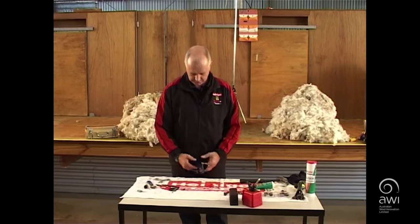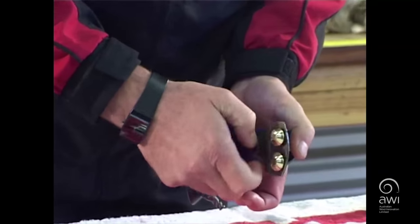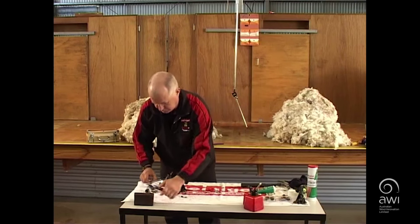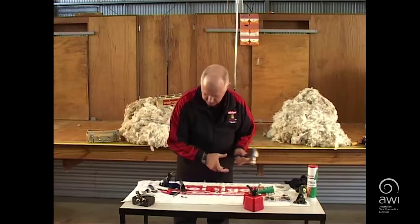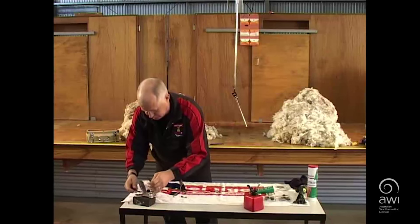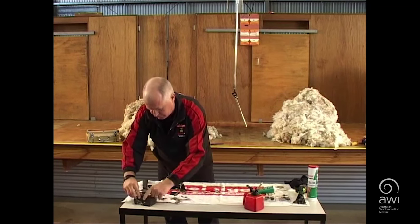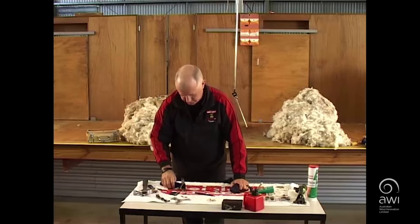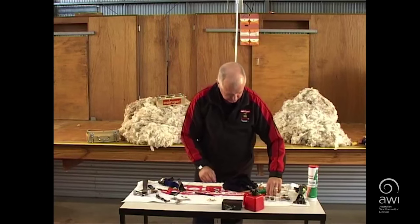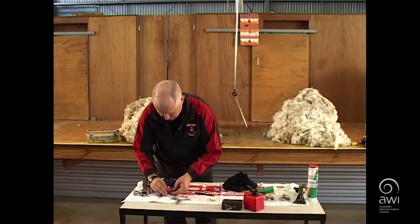Rebuilding your handpiece from the front end. Take off the centre post lock nut and screw out the post. Then place the cup over the hole and knock them out. Remove the chicken feet and clean up the fork. Separate the old parts from the new. Place the tension pin retaining spring on the cup and put it in the fork. Ensure that the slope on the cup face is angled directly to the ball race at the end of the fork.